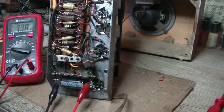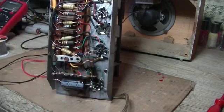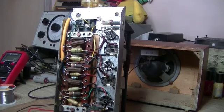Not bad at all. And that's just using the ferrite rod as the antenna - pretty good. Not much to do - it's a done deal. I'm just going to swap out those mustards. After all, mine are from '58, so almost 60-odd years old. Best to replace those. I'll do that and we'll come back and wrap the video up.